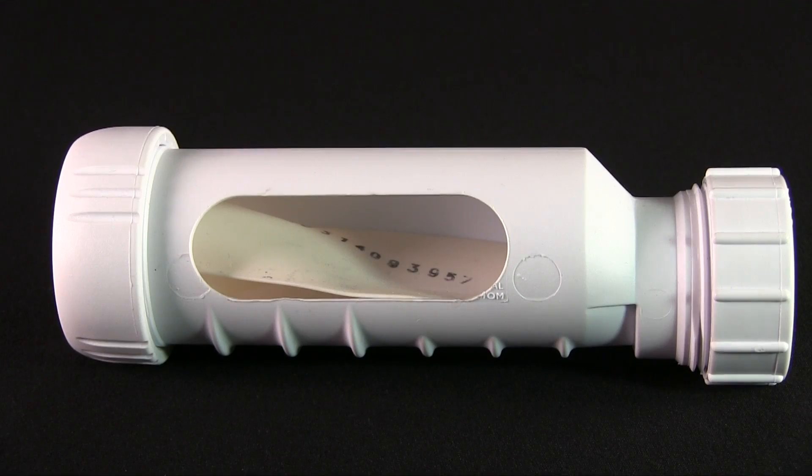The installation of the HepVo valve eliminates the need for an anti-siphon trap vent device and the tee. The anti-siphon trap vent device, by the way, can fail and allow sewer odors to enter the living space of the coach. If you ever smell holding tank odors under just one sink, chances are it's a failed ASTVD.